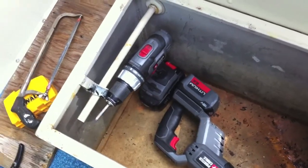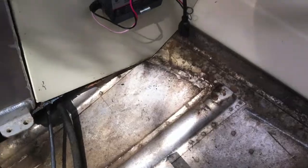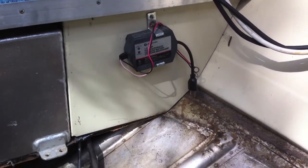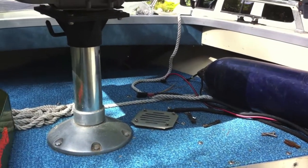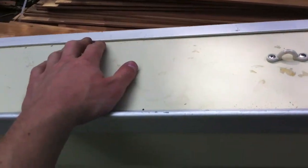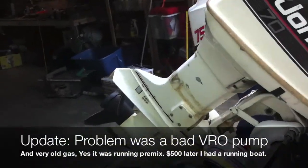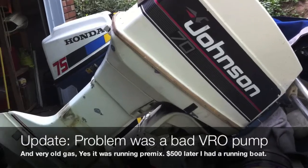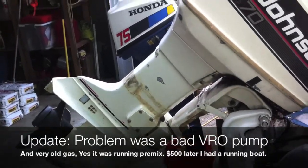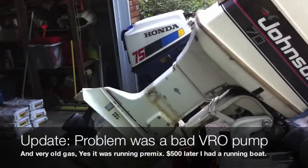This might become a cooler - could keep beer cold, I don't know. It came with a little battery tender for a trolling battery with big wires for the trolling motor. It's in pretty good shape. This motor runs and will start on the hose, but when you give it gas it just dies. I got this boat for two grand with everything - taking a chance on the motor.